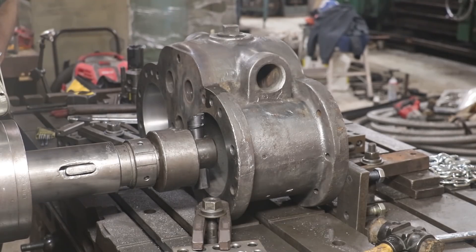We got lucky and got the digital readout working — we dialed it over 12 and three quarter inches, which is what the blueprint says. It's within just a thou or two measuring with the feeler gauge of where it needs to be, so we're just going to let it rip. We don't know how good they had it to begin with — probably no more than within five thousandths of print. You do have some tolerances. We're ready — fire it up and cut away.